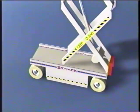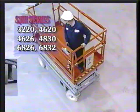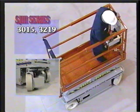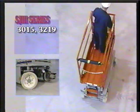As we continue around the base of the platform, we come to the steering and drive wheels. SJ3 conventionals are rear-wheel drive and front-wheel steer, while SJ3 compacts have front-wheel drive and steer. This allows the front wheels to turn at almost 90 degrees. Front-wheel drive and steer units are able to turn very sharply. Be aware that when the steering wheels are completely turned, the front of the work platform moves at 90 degrees to the right or left. Use caution before driving while elevated, especially where holes, drop-offs, or other potential hazards are immediately beside the work platform. Be aware of the direction the wheels will travel.